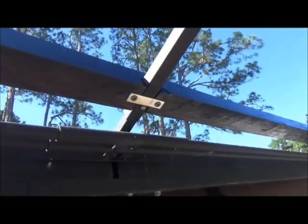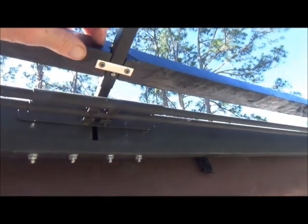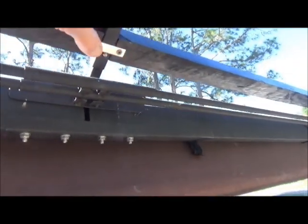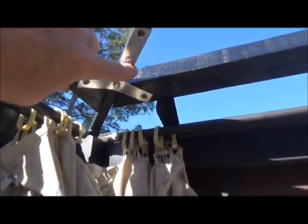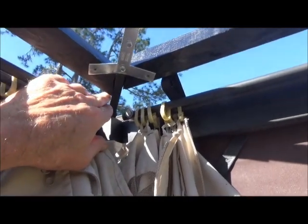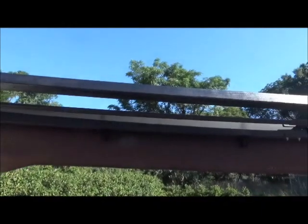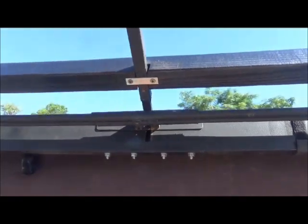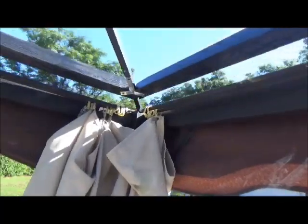And what I've done is I've put these brackets in there, so the cuts I made were somewhat smaller than 3/4, so I just went an 1/8 inch under. That way when you put the brackets on, it sucks it down. Same thing with the corners. I put these brackets on there. I know my miters didn't come along real great, but doing these angles was really a pain in the ass, and it took me a lot longer than I'd anticipated. I figured a couple hours or whatever, but this whole thing, whoops, tripping on my stuff here.